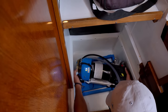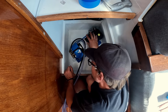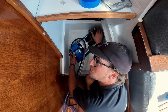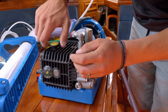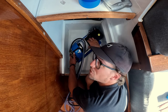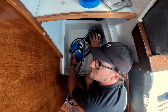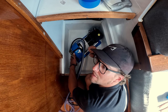It's a heavy little pump — not so little either. When mounting this motor there are a few things to take into consideration. Number one, you need to be able to maintain it. The two things on this motor slash pressure pump are the impeller, located on the front — that's the boost pump that circulates all the water from the seacocks through the pre-filters and into the pressure pump — and the pressure pump itself. You need to access the oil sight glass to monitor oil levels and be able to drain it for an oil change. This motor is on a cool Rainman-specific tray where you can pop off the sides without unscrewing the base mount, and the whole motor can be lifted out of place — that is very cool.